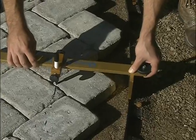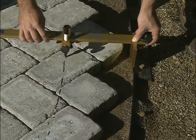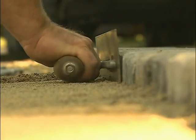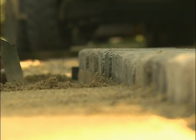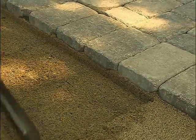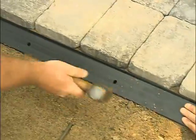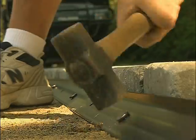Mark with Quick Draw for soldier pavers. Installing Pave Edge before sand and pavers saves time and money, and allows the installer to use tools such as Quick Draw, which marks cuts for the soldier course. If edging needs to be installed after pavers are laid, use a trowel to cut down along the back of the pavers. Pull away the excess bedding sand, being careful not to scrape up the base material. Next, slide the sand retention lip under the bedding sand; this may require tapping the back to get a tight fit. Toenailing the spikes helps draw the edging tighter to the pavers.